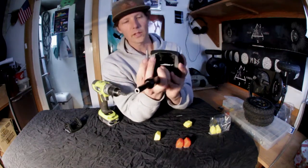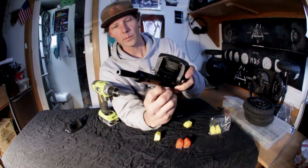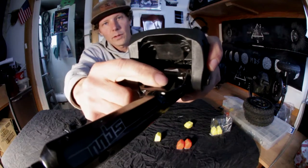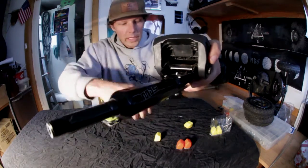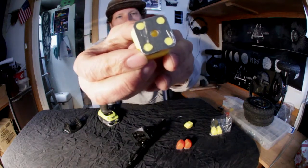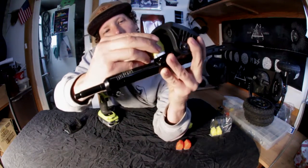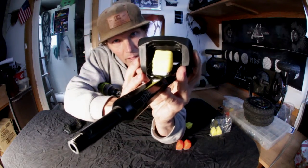okay? So, but before you place them in there, what I do is I take my adjustment screw, alright, and I screw it in, but just a couple turns, okay? Just a couple turns, so it's actually biting the thread. But you can see that the end of the adjustment screw is actually sticking up above the surface, okay? And that gives me something to actually locate the shock block onto. So in the bottom of the shock block, you'll see right there, there's a hole, and that is what is going to be located on that pin. Okay, so once you have that there, I'm just going to slide that guy in until he goes straight onto the pin. Okay, and you'll hear a little click, and it sits nice and flush on that pin.